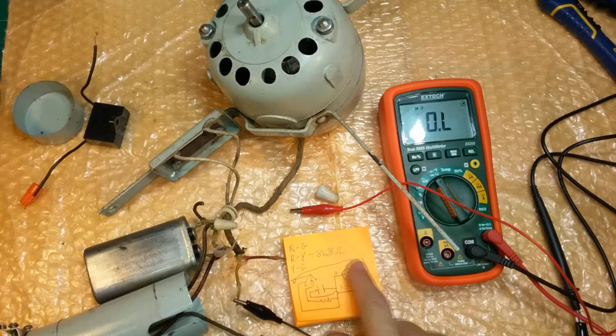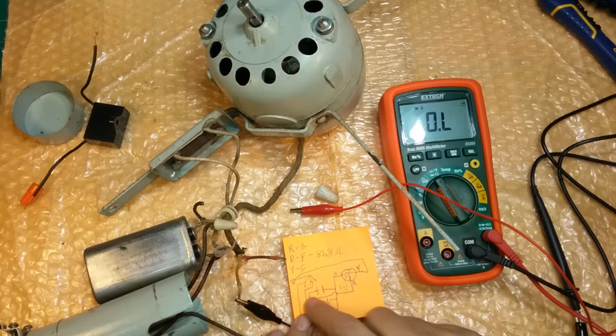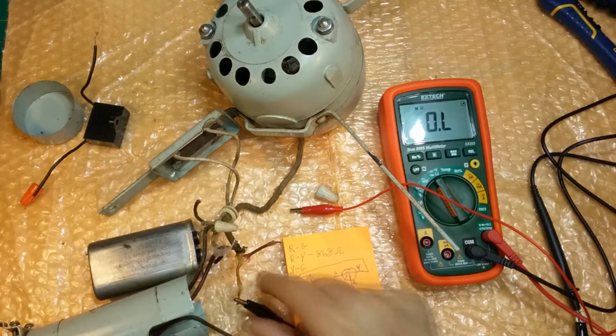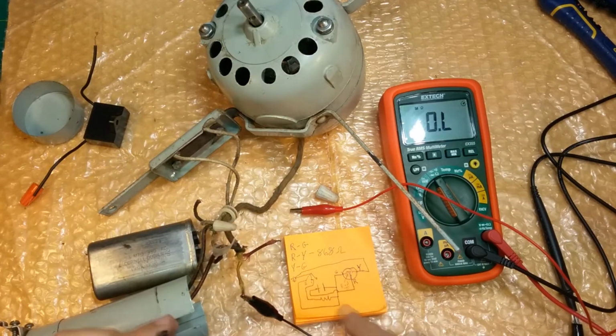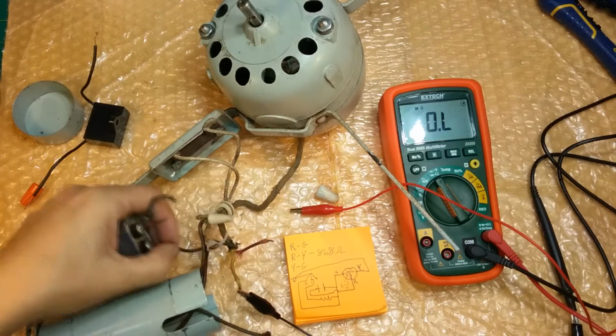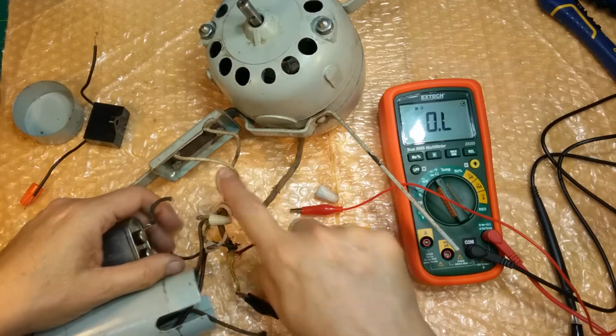We know that, and we already did, the red goes to the line, to the capacitor. Right? Yeah, the red went to the capacitor, they were connected together. The yellow goes directly to the AC line, that's the one that was loose in the can when we opened it, and this is the other side that goes to the AC line, which is a switch. Okay. So we know where everything goes. Not worried if that capacitor line breaks off, it's a black wire, just like the other black wire, they're the same, so I know which one's the capacitor, and we know it connects to the green wire with the resistor. So we're safe on all that.